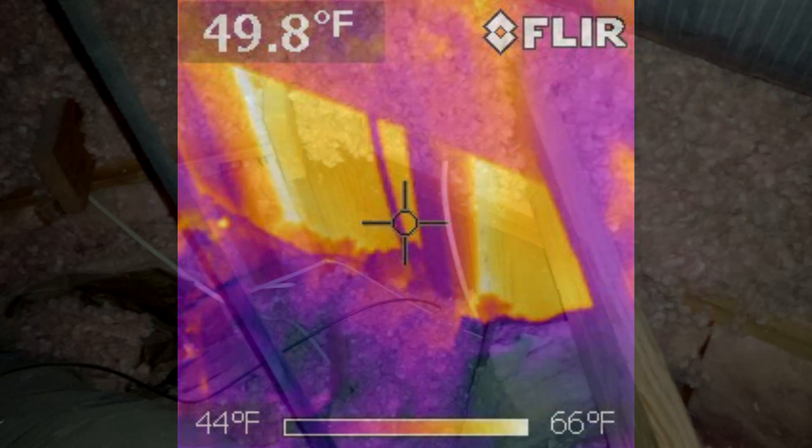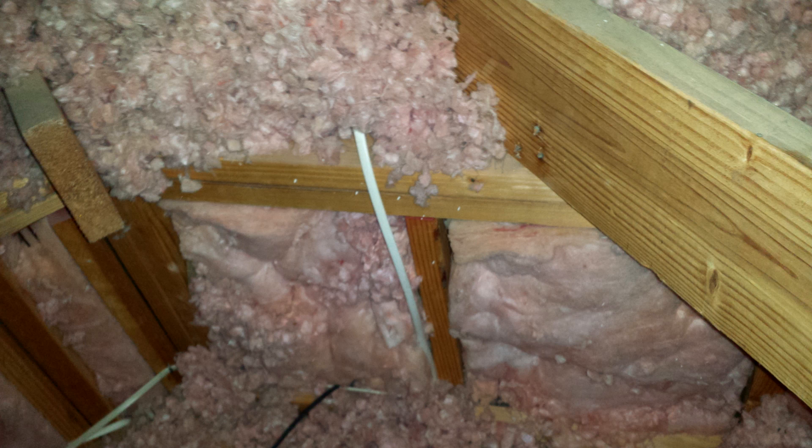The red squares showed heat coming from the inside of the house. So I shined some light down there and lo and behold, someone had pulled the insulation off. This is a house that we just bought about a year ago — they pulled the insulation off around the wall and didn't cover it up. So I put the insulation back up and it worked great.